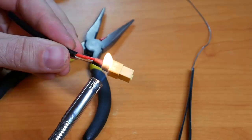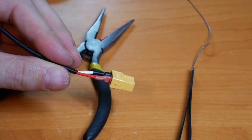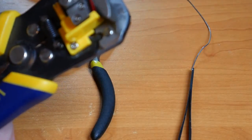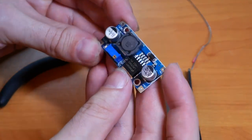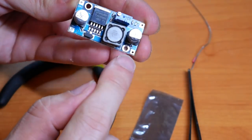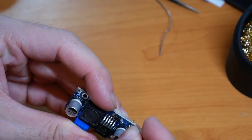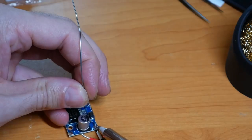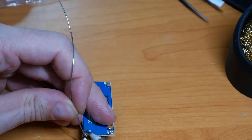Repeat for the other side: solder it, slide down the heat shrink, use the heat to seal it up, and your first plug is complete. With quite a short length, cut and strip the other end, as that side is going to go into the buck converter. The buck converter is clearly labelled with which sides are inputs and outputs, as well as the positive and negative terminals. This first plug goes into the input side — the wire thickness is a little too much to go through the holes, but just push it in as neatly as possible, solder on top, spin it upside down, and solder on the bottom.